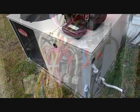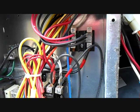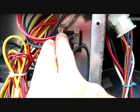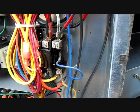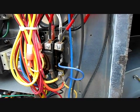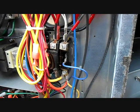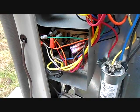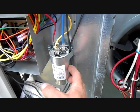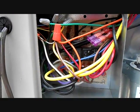I'll do a little inspection of the electrical components. In heat pumps like this there are two circuits — typically two 240-volt circuits. The first one powers the heater, comes into the set of lugs here, and travels down to the heater contactor. The second set powers the compressor. Typically either circuit will power the transformer — some Goodman units do it on the compressor circuit, some on the heater circuit. We have a low voltage transformer, low voltage fuse, dual run capacitor, single run capacitor for the fan, a defrost board, and a defrost timer.